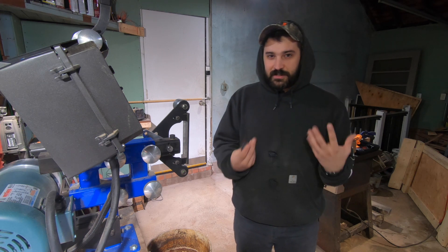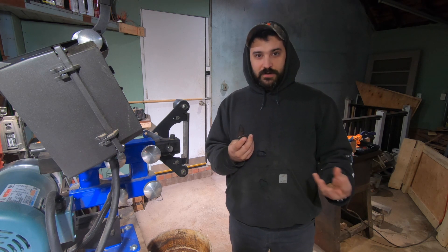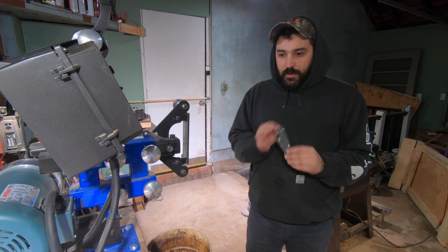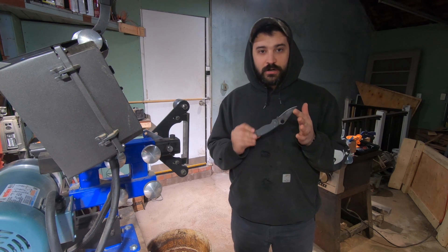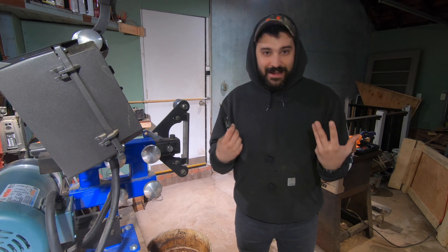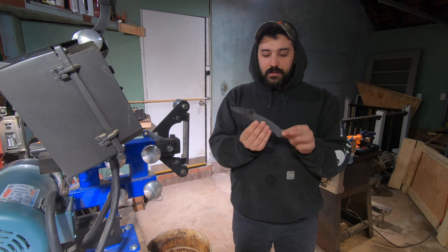Very, very little. And there has to be enough tungsten to kind of do that. Take your chromium down so you're not diluting other things. But cobalt is a big one that helps with this high hot hardness. Basically, if this steel gets to a certain temperature, it will maintain its hardness or stay hard. We can get up to 70 HRC — a little higher on some of the handmade stuff.